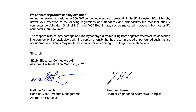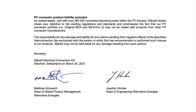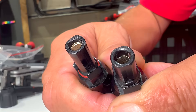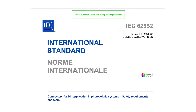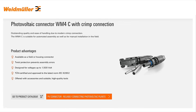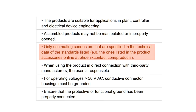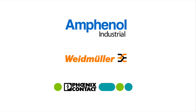A manufacturer may create a connector that passes tests when paired with a Stäubli MC4 connector; still, any changes Stäubli makes to its manufacturing processes or materials could invalidate that independent testing. I can demonstrate this with these two connectors: although they appear similar, the depth pin used to check correct crimp engagement — supplied with the Stäubli toolkit — does not even fit the barrel of this equivalent connector. That's not to say this solar connector is not high quality; as a system of mating parts it has passed the tests defined in IEC 62852. You will also find many well-known connector brands such as Phoenix Contact, Weidmüller and Amphenol supplying solar connectors similar to MC4, which may indeed mate with one another. However, they are also accompanied by disclaimers within product data sheets stating they should only be used as a system, and mating with other systems may not be covered by the product warranty.